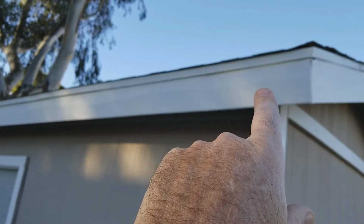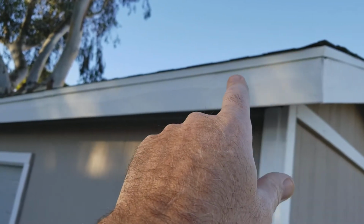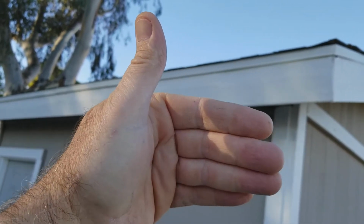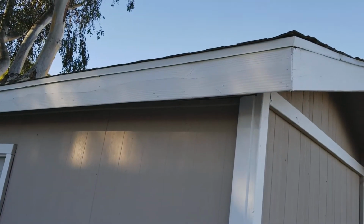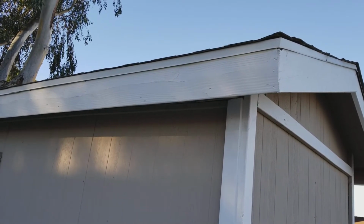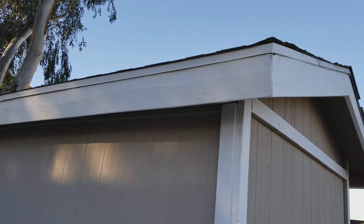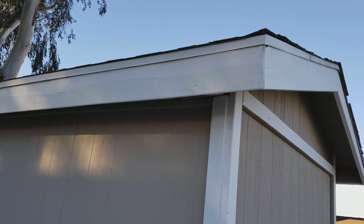And I actually had a house where the paper was on top of the flashing, and they didn't have a flashing on it, and it was cut in the middle. It was a tile roof, and the water was coming up, going down the fascia, causing her paint to peel. We had to call the roofer out to have it redone, because she's like, I just had this painted like 2 years ago and it's peeling already. The guys didn't do it right. That's what she said, the painters didn't do it right. See, we get blamed. So you need to know your stuff to prevent this from happening to you.